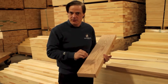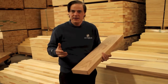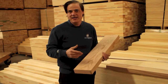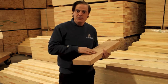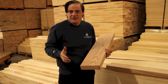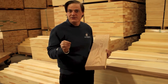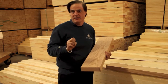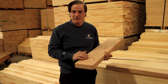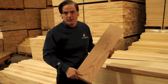The downside with oak is that it will expand and contract. So once you've installed your front door, depending on what season it is — whether summer or winter — your carpenter has to take into consideration whether the wood is at maximum expansion or maximum contraction. If he installs the door at maximum contraction and leaves a very tight space on the side, come summertime the door will expand by three-sixteenths of an inch and actually rub against the frame. That would not be the end of the world — he would just have to come back, refit the door, and from there it will always function properly.